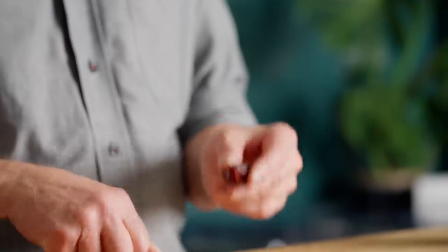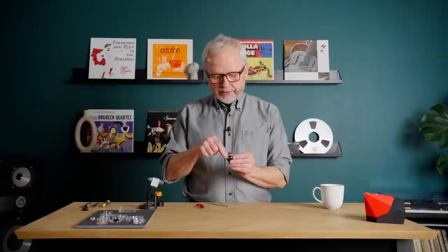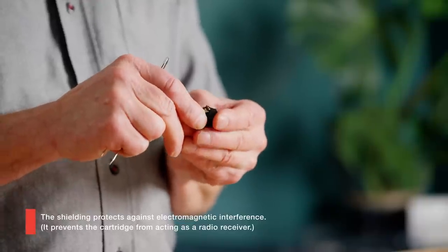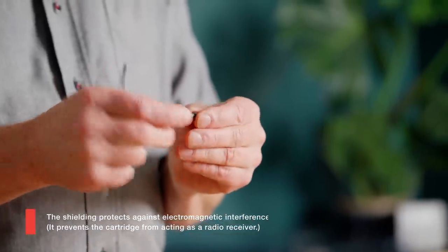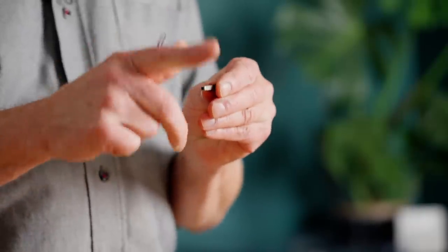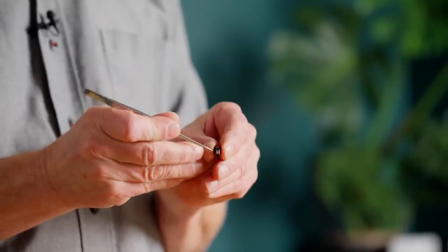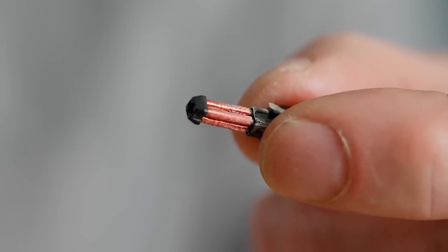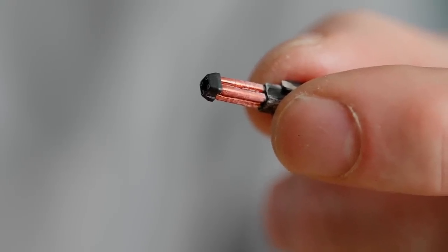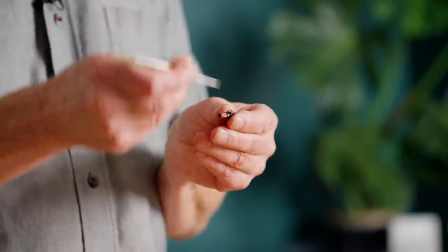That coil system is in the other part of the cartridge. So I will take this one out, and then I need to look closer at what is inside here. We have a shielding here — that shielding is to prevent against noise. I will take this one out of the body like this, and the shielding is still on. Inside here, this is where the magnet will be sitting and moving around. Now I can take off the metal shielding part, and now you can see coils — these are coils wound from very thin copper wire. There are a couple of thousand windings on each of these four pins, so the wire is really, really thin and the coils are really huge. This is why they will be stationary and not moving around.